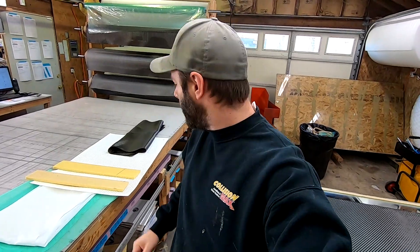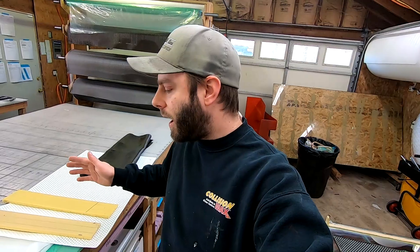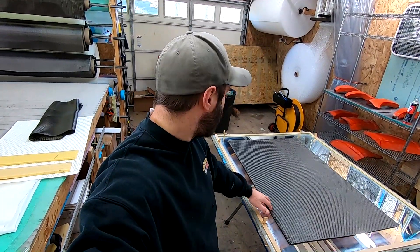Even though this is a flat panel, there's a lot to it. I'm doing something unique with two different types of core materials at different thicknesses to get the end product we want. We get to lay everything up dry so we can take our time and make sure we get everything how we want. We'll time-lapse through the layup — I just went through the steps so you're not really missing much. It's a little time-consuming and tedious. Let's get the layup done and get it in the oven and infused.